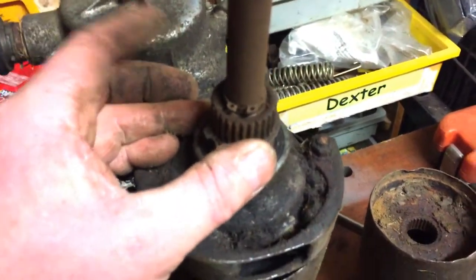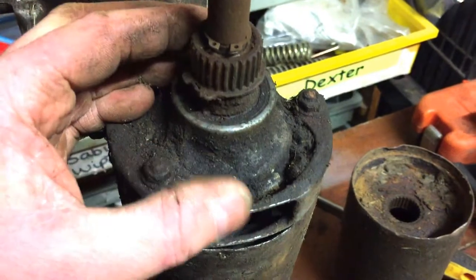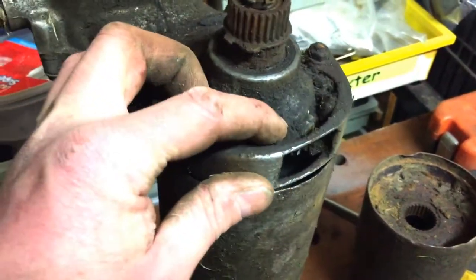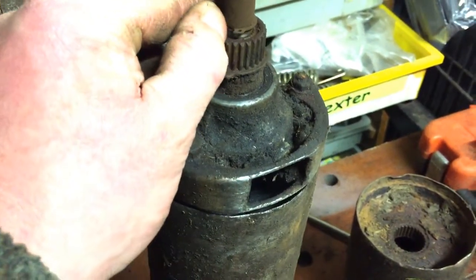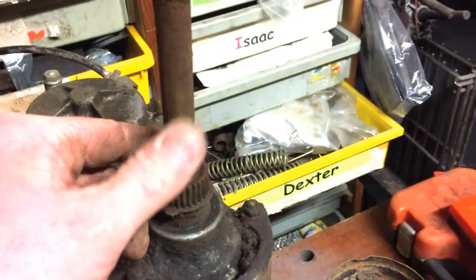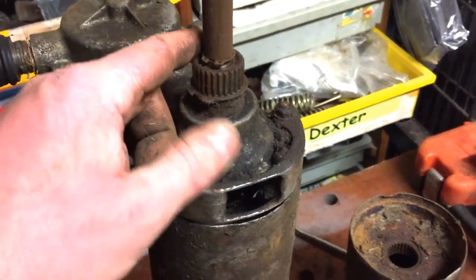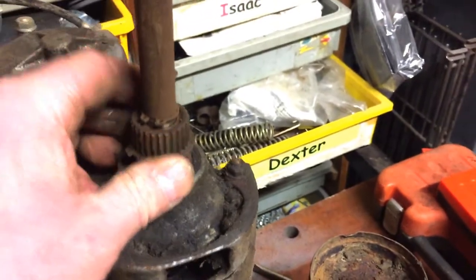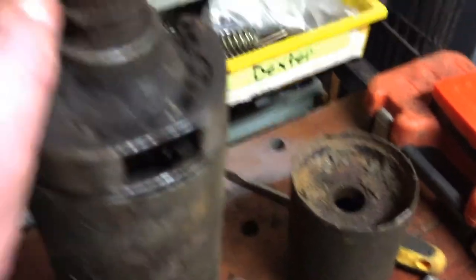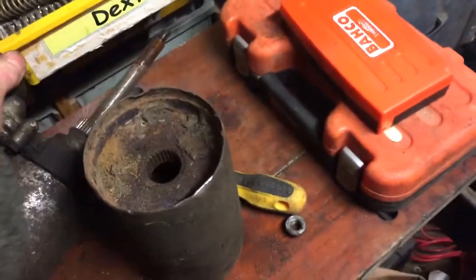Some of the earlier ones had greasing; some of the newer ones have oil in. If I took this part I'd put oil in it, but I'm not going to take it apart if it's dry. There's a circlip that will allow me to get the drive off that shaft, and there's another the same configuration in the bottom part. I'll take it all off and give it a really good clean. It's drier than it could be — it needs a good grease up. I'll scrape it all out, clean it the best I can, then put it back together and it should be good for a while.